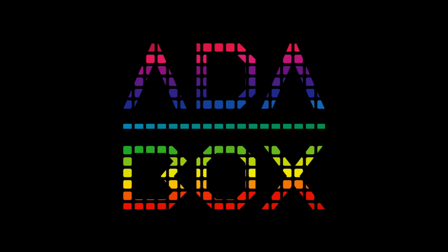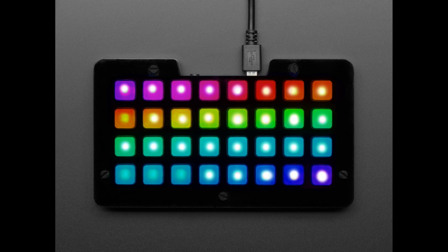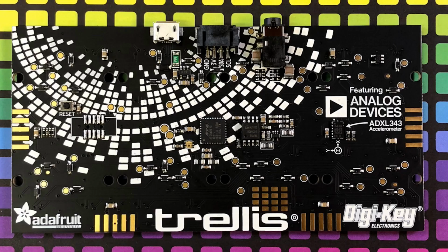Adabox 10, Rainbow Trellis. This Adabox is a multi-sensory feast. Lights, sound, squishy buttons. This box comes with a Trellis M4. It's a grid of 4x8 silicone buttons with a NeoPixel behind each one for rainbow glory. The engine is an ATSAMD51 microcontroller with stereo audio channels and microphone input.